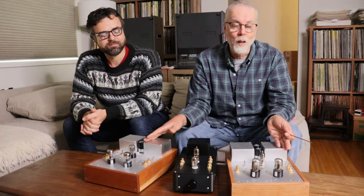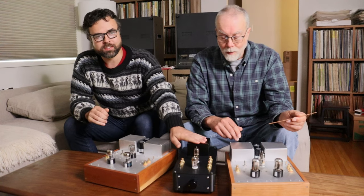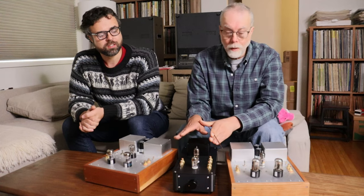We're really not a hundred percent sure why, but we're digressing. So here's the new prototype. You might say it looks like the old prototype — well, it is almost exactly the same. The big difference is that we're running a different cathode follower. We're going to run the 6N6P, which is the same cathode follower that we ran in the 6N1P preamp, which is the first of our modern line.